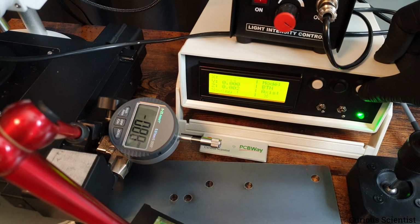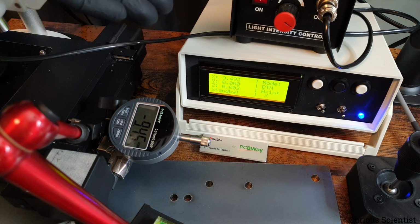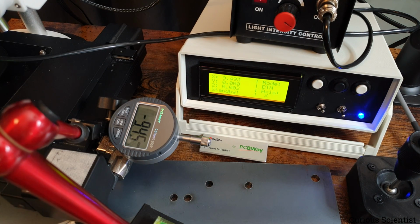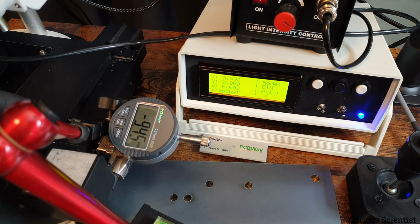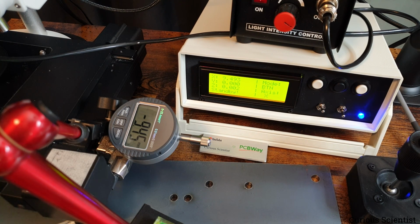But you can see that it moves correctly. So 45, 49, it is what it is. I still accept that difference because again, let's say 40 micrometers, again human hair order of magnitude. So the x-axis moves with this kind of tolerance and precision, and the y-axis has exactly the same lead screw, the same backlash correction or anti-backlash nut, and the same bearings. So I would not test that because it would give the same results, hopefully.